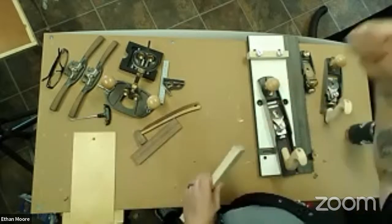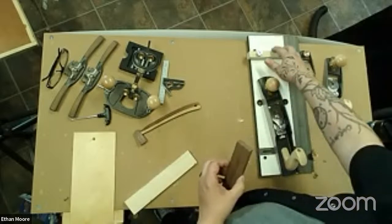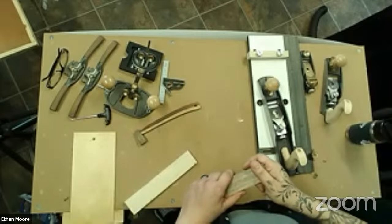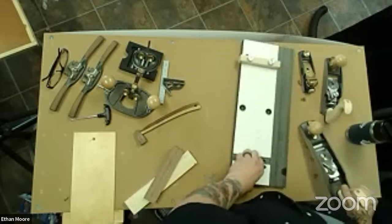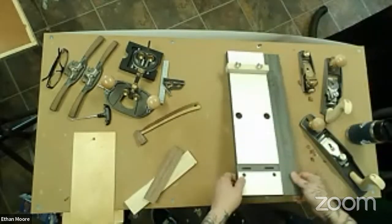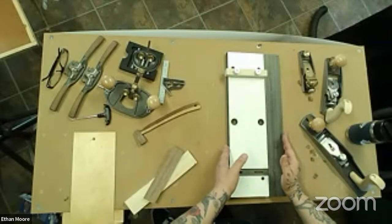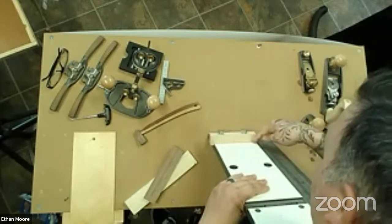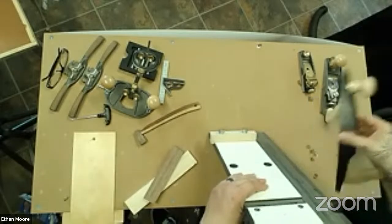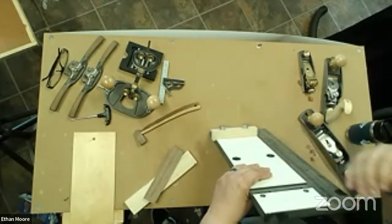So the jack plane covers: flattening, jointing, and end grain work with a shooting board. You don't have to buy a shooting board — you can make one. This fancy one is made out of phenolic with little rubber feet. Literally, you just need a fence and two levels — one piece of plywood slightly larger than the other. The only thing that matters is the relationship between those surfaces. Even if it gets a little out, you can take that up with the adjuster on the plane — if it's so far out that you can't compensate with the adjuster, you probably should take up knitting instead of woodworking, because that's really out.